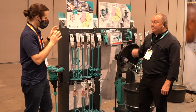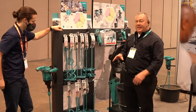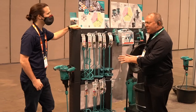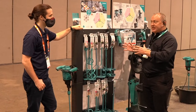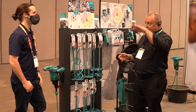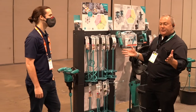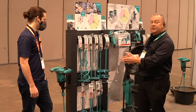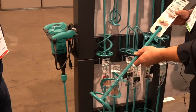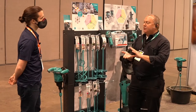We've got a lot of paddles here. Can you walk us through the different uses, purposes, and materials these are intended for? That's a common issue for tradesmen — they see this variety of paddles and think, what's this all about? There are really only three possible ways you can mix: bottom up, top down, or side to side. Every paddle out there is one of those three. With this style, you can tell just by looking at it that it mixes from the bottom up. Bottom up mixing is for thick, heavy things — concrete, mortar, concrete with aggregate, grout, that kind of stuff.